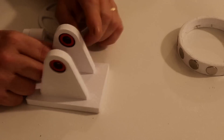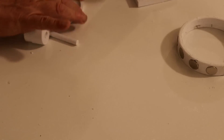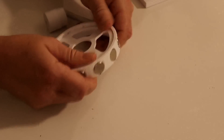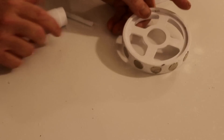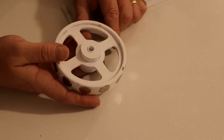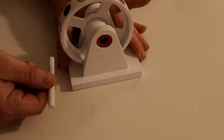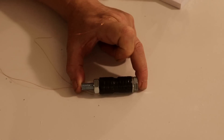Then take the stand and push a couple of skater bearings — which are 22mm by 8mm by 7mm — into the stand. Then take this piece here; it pushes in this way around into the ring and glues in. This other piece pushes in that way around and glues in. We feed that through and insert the axle.